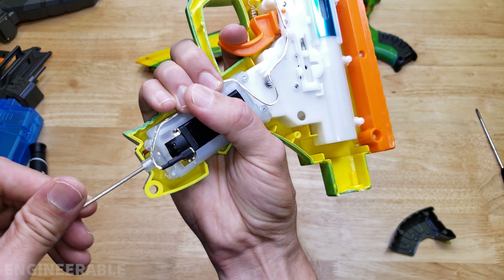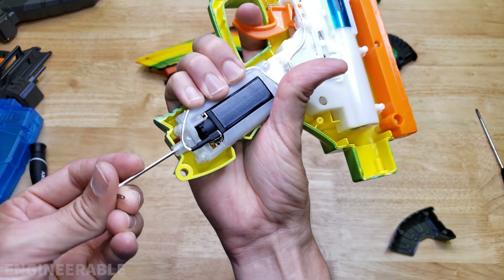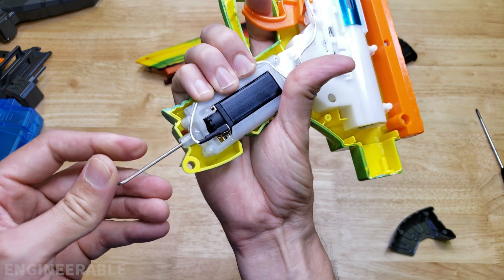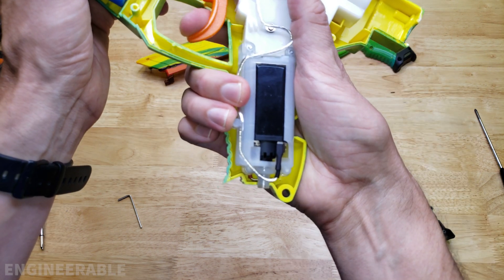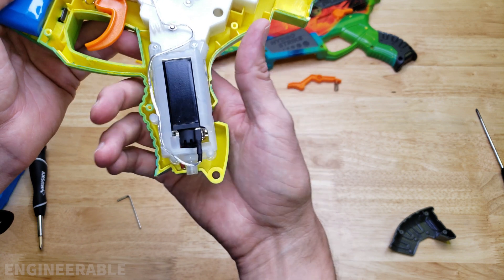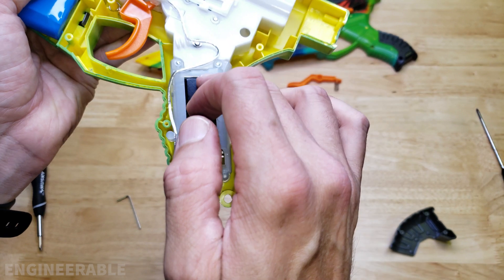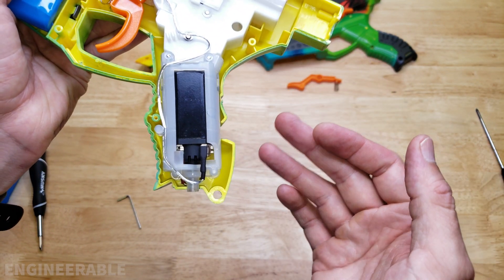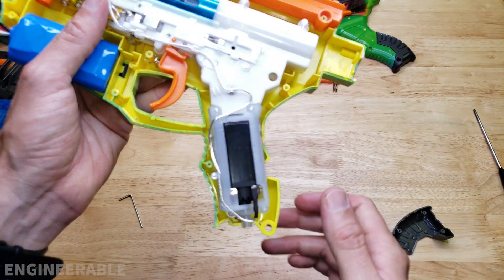Back it off. You back it off until the motor sounds smooth — that's the position you're looking for, which is pretty close to the factory setting. So if you hear a motor whine or gear whine, it's too far forward. Just back it up a little bit until you stop hearing that whine. That's the easiest way to properly adjust the motor without having to take it apart and shim stuff.